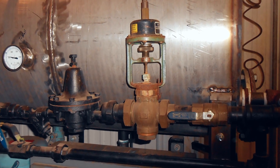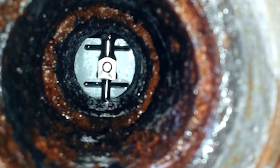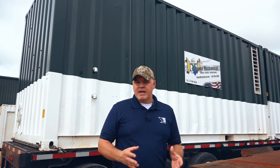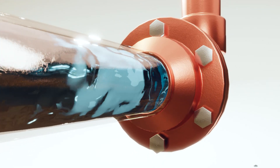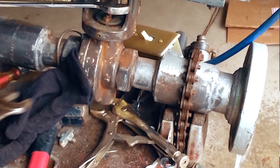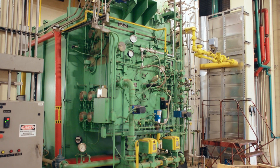There are numerous types and brands of both the valve and the actuators used on many of these systems. The sliding gate valve design is one that has been used in feed water applications for decades. The two-part gate is made up of a stationary gate and a movable disk with orifices that aid in delivering reliable and consistent flow. Some of these designs can have problems with leaking past and flooding the boiler when it's offline or in standby, which will also create problems when the boiler is refired. So not only is flow critical, but watertight shutoff is of utmost importance.